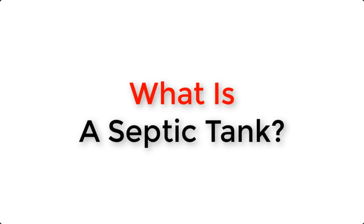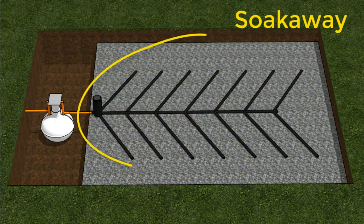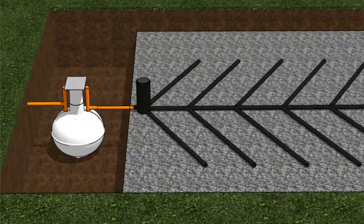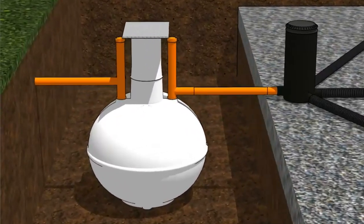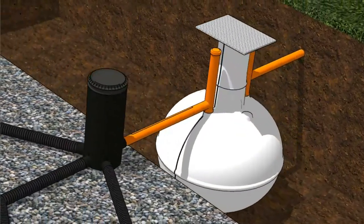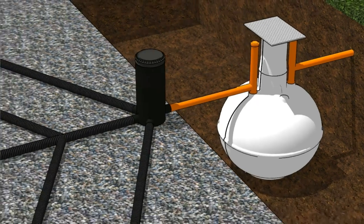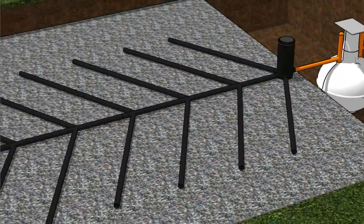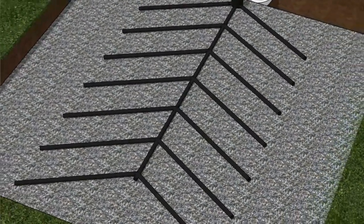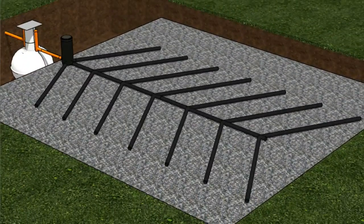So, what is a septic tank? Well, let me show you. This is a septic tank, and this is the soakaway. A septic tank is a large holding tank that's buried underground, and they can come in various shapes and sizes. This is what they call an onion tank or a bottle-shaped septic tank. Soakaways also come in different shapes and sizes and can be made from various different materials. This particular soakaway is called a herringbone design because it's in the shape of a herringbone and it's sitting on